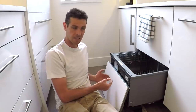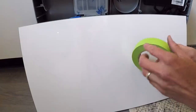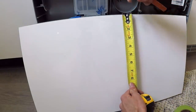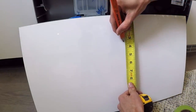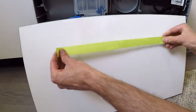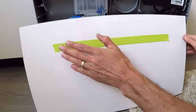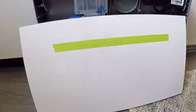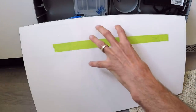One of the things I often like to do is put a little bit of tape where the hardware is going to go, just to make it easier for marking. So I know it's going to be right here — three and three sixteenths is going to be roughly my center, so I'm making a very small mark. This step isn't totally necessary, but it makes it easier to put marks on and see them, and avoids scratching the surface.